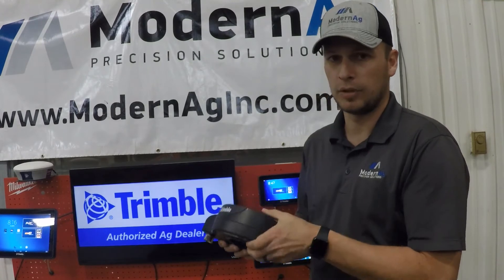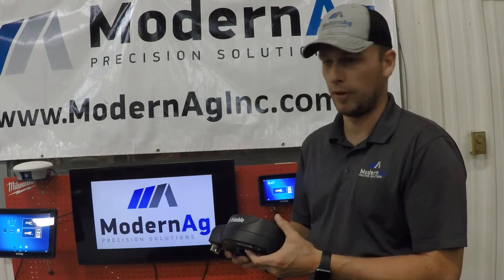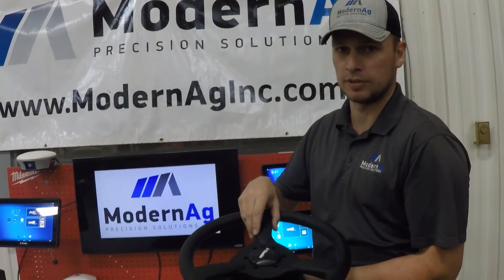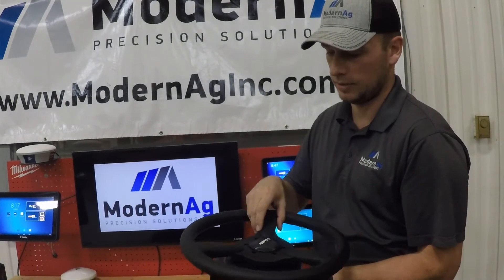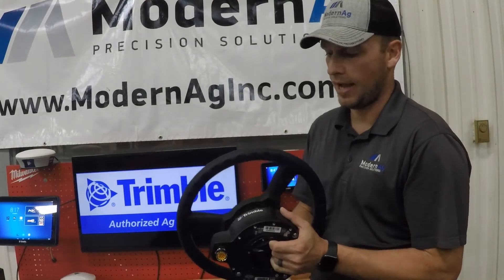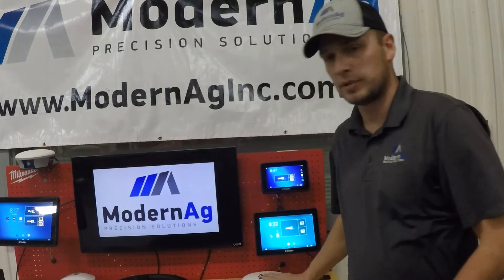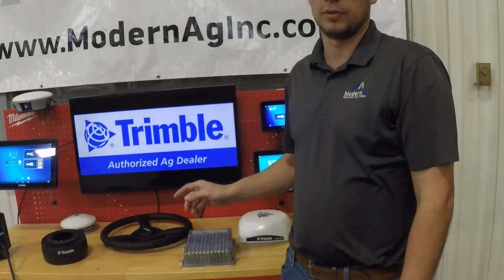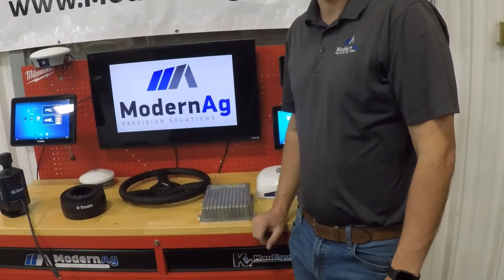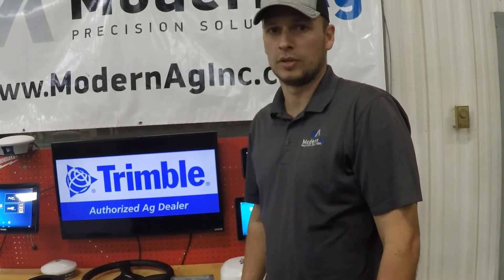You will slide this motor right down on the spline and also have an anti-rotation bracket to keep it from rotating. On top of that we will have our Trimble steering wheel — a nice OEM steering wheel that you can add to act as your steering wheel. As part of this you will either have an IMD 600 compensation device or a NAV 900 compensation device mounted to either the floor or the roof. This system works well for a lot of our older tractors that need to be planter tractors where we need good three-dimensional accuracy.